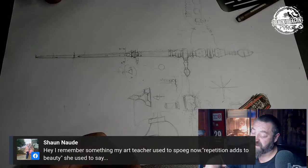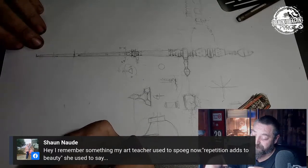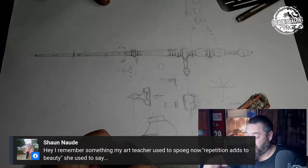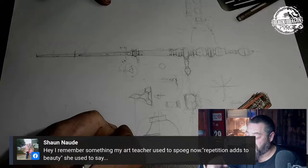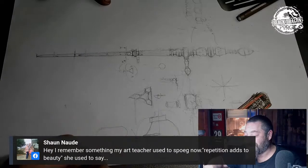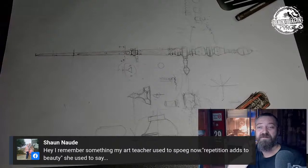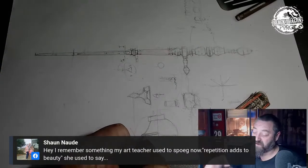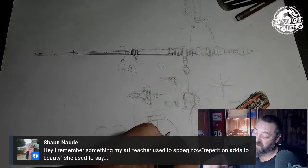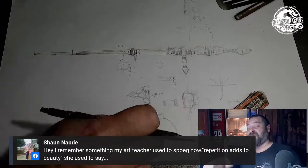Now, go and figure out if I only have a three millimeter radius file. What you can do, you can slice the file. So take away half a millimeter on this side, half a millimeter on this side, so that you end up with a file that does that. Yeah, but as soon as you roll the file in your hand, you're going to open this up. It's also nice for getting broader sections in. So in other words, filing in ovals. But that won't work there.